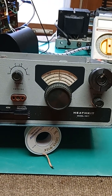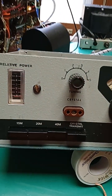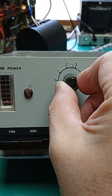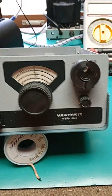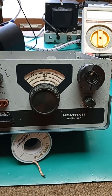I always wondered why I couldn't get much further than a couple hundred miles on 40 meters with this rig. The Heathkit advertised it as 3 watts. Relative power, 0 through 5 — key it down and turn the tuning control, and the pointer would rest about 3. So I figured the manual said 3 watts and the pointer said 3 watts, it must be 3 watts. Well, Heathkit lied. More on that in a minute.